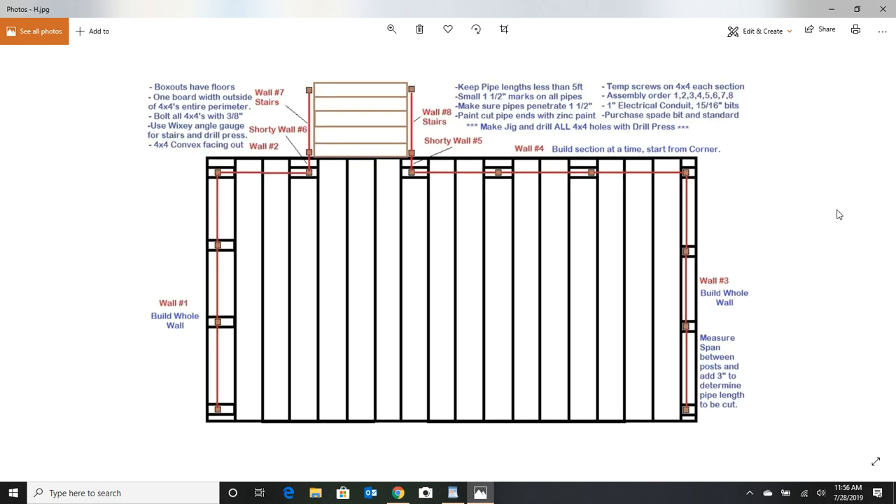This part of the video is important because I found out the hard way that if you assemble the walls in the wrong order you're going to be in a world of hurt. All your 4x4s are going to be bolted in — two bolts on each 4x4 — through these box outs. You're going to build these box outs. My deck is 16 by 24, but you can change it to any size you want. It's important to remember: don't put your short ends of the box outs in yet — you need them to be rectangular, and there's a good reason for that.